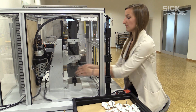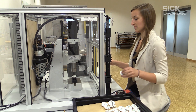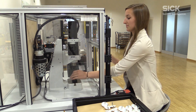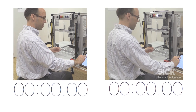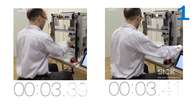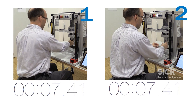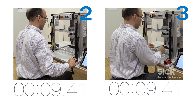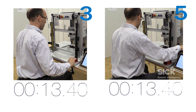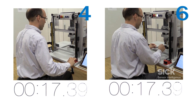With PSDI, the operator's hands are free, allowing them to handle the work pieces in the most efficient way. In this comparison, 10 pieces are produced with a pneumatic press. Traditional two-hand control operating mode is used on the left side, and PSDI mode is used on the right. In PSDI mode, the operator can immediately prepare for the next cycle after placing the work piece and the tool.